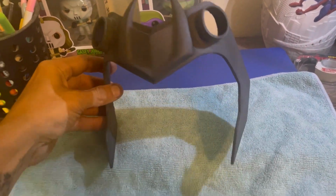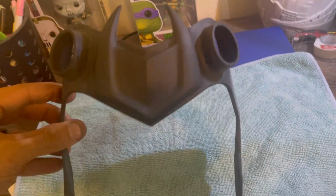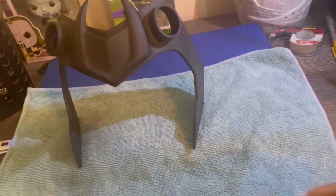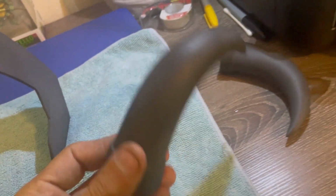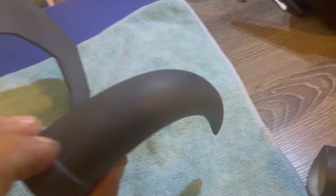So my last step in this process is basically sanding the whole thing with 400 grit sandpaper. Now the reason I do that is because sometimes when you use primers, and depending on how you tilt the can, you get overspray or a little bit of roughness on the edge, and we don't want that to bleed through the paint. So I knew I had enough primer on here, so I just did a 400 grit sand on everything to make sure it was all nice and smooth and clean and uniform, and prepped for our rub and buff.